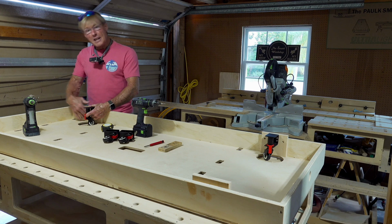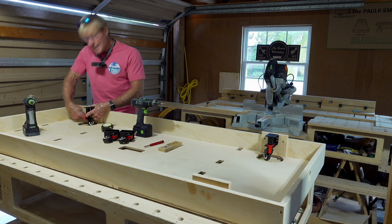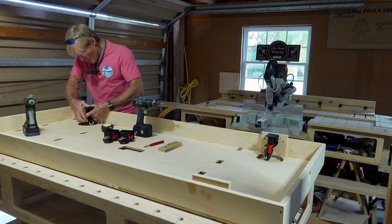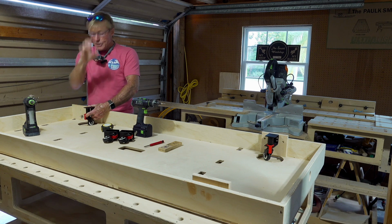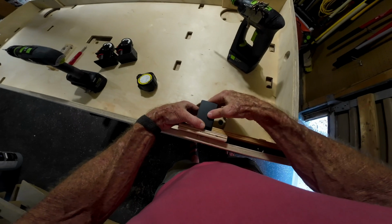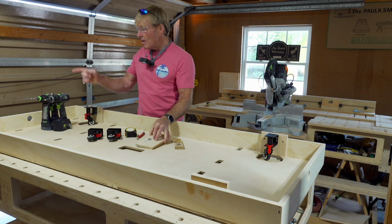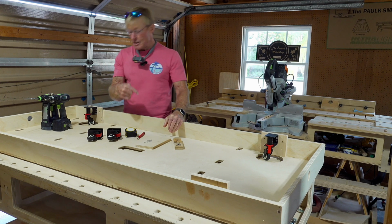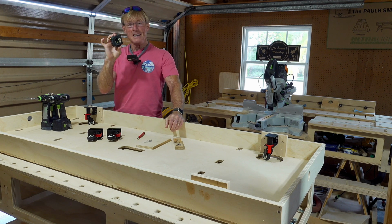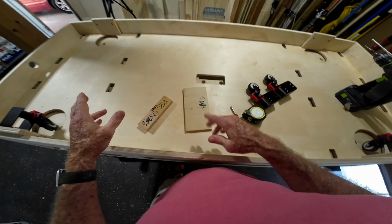The wheel needs to touch the floor, so that pushes down in that dimension. And because this is a nice square cut, I'm able to hold the bracket to the wheel nice and square. Now I don't need to think about it, I just put in the 4 screws. With this same block, now I'll go around and mount the other 3 casters, not having to pull out my tape measure. This is an actual project that I'm doing right now that I showed you this workflow, this concept.